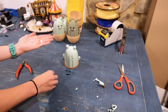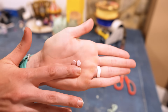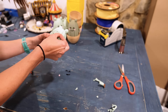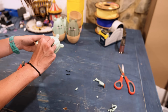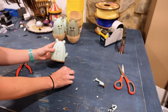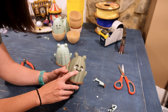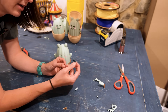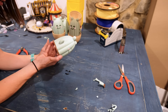I lowered the layer height of the cheeks down to 0.12, and I think it helped a ton — you can barely see the layer lines. These fit in perfectly because of the way the supports worked; I don't even need glue on the cheeks. The mouth fit way better this time too. I resized it slightly — on the previous version I used 0.1 clearance, and I increased it to 0.2 — and it fit a lot better, though I still need a little glue. Just a smidge of 3D glue, and we have our cute little cactus.